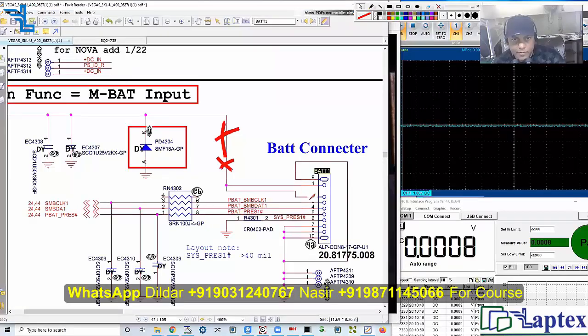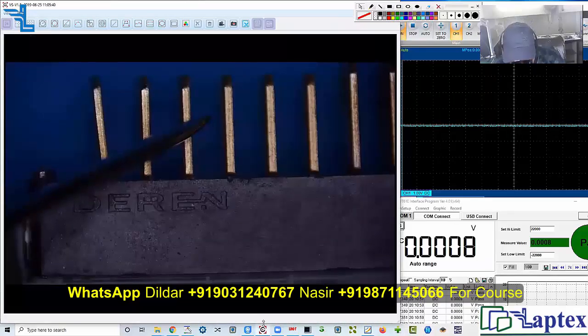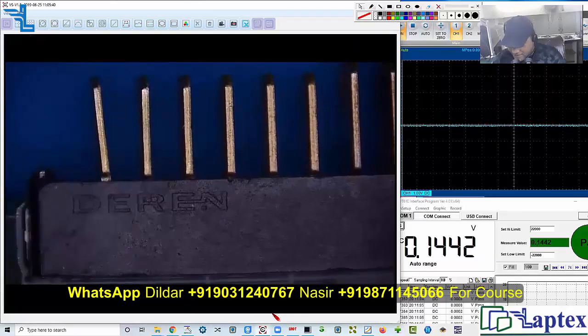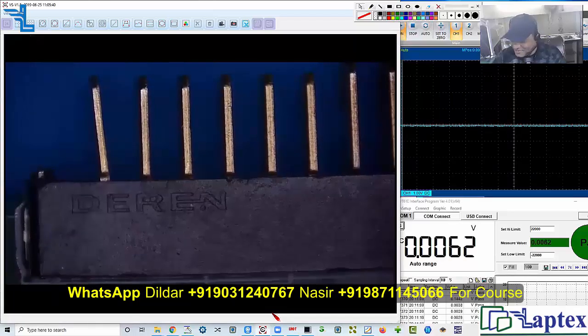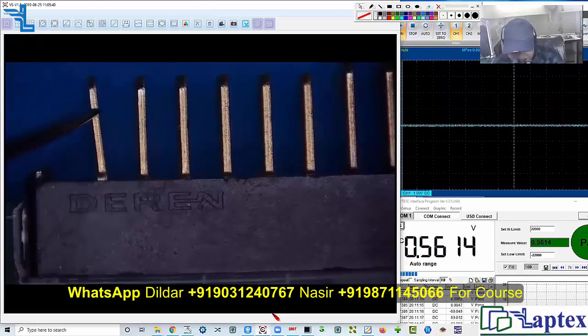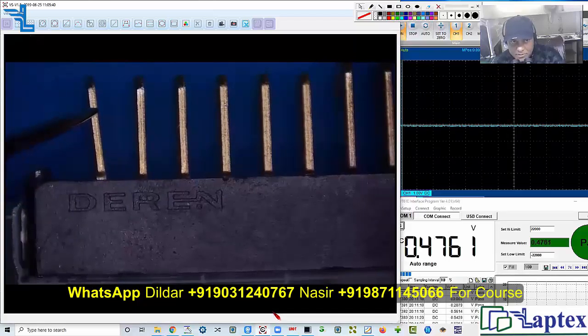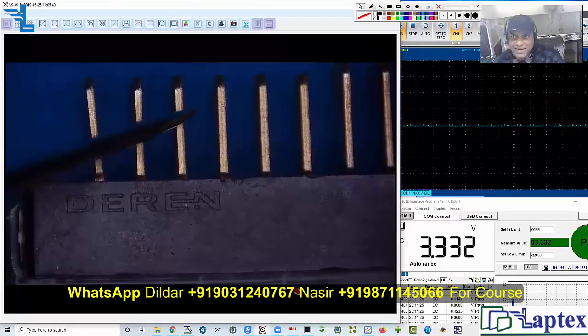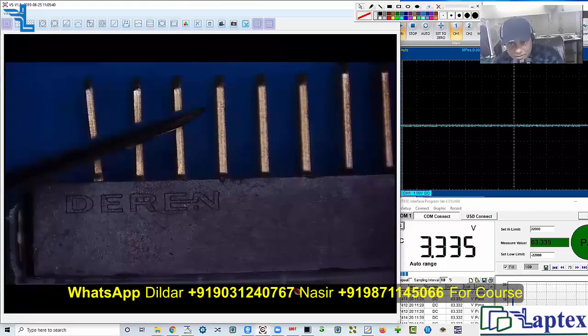What is this? This is the clock. Clock has voltage. Okay, now for the data — actually I was not using the DC jack. Sorry for that. Now let me confirm once again: we have no voltage on the battery positive. Two pins are dedicated for the battery positive. Clock — yes, we have it. Forgot to use the DC jack. Okay, we have clock.